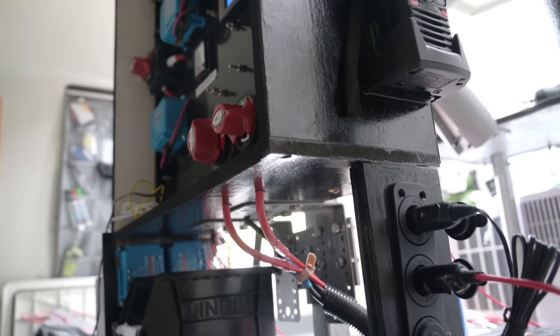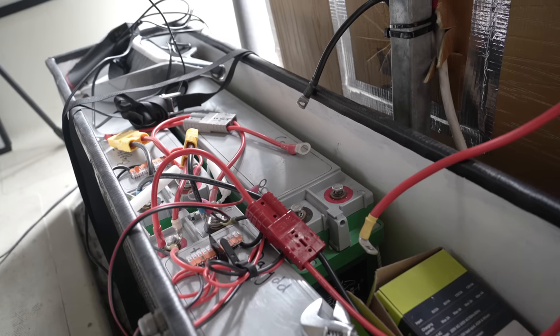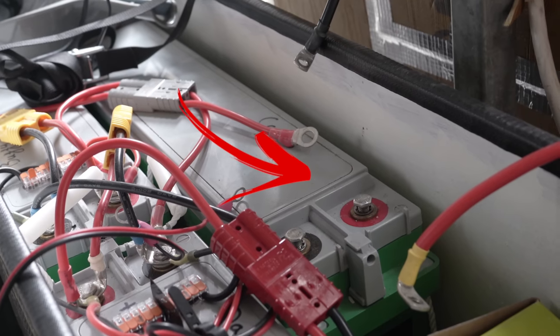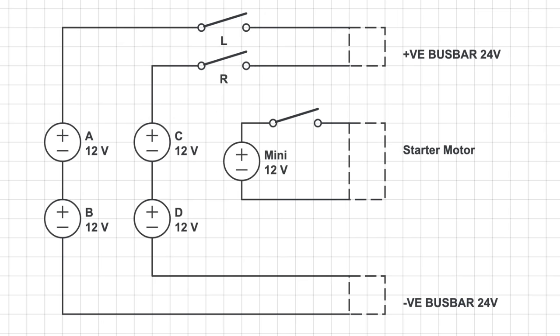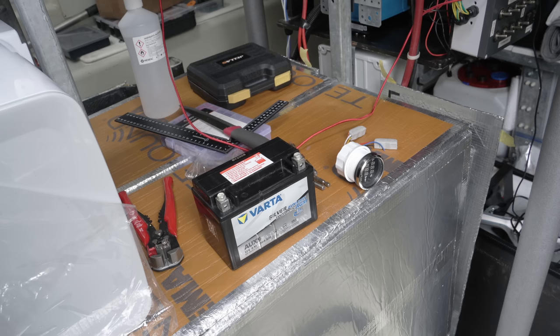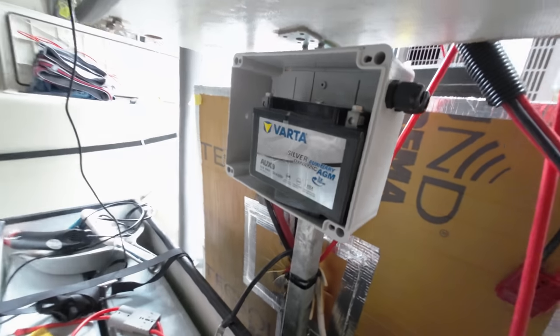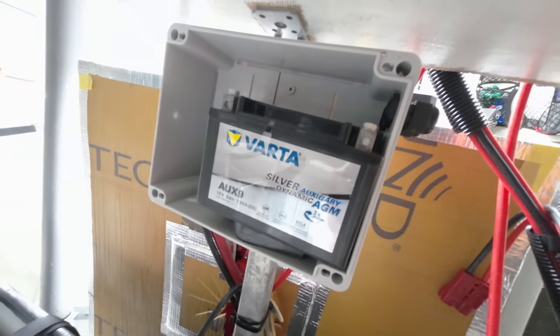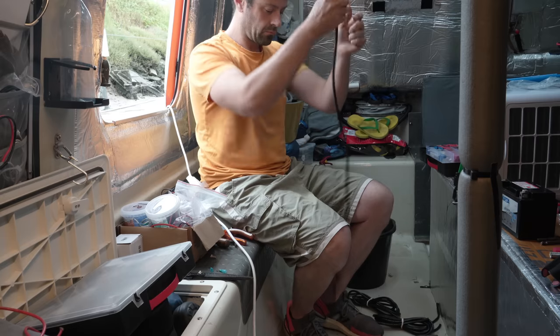We're going to head to the main electrics panel and below to the battery bank box. To date I've run two 12-volt lead carbons together as our main 24-volt power source and a third as an engine crank. I'm saving up to buy another lead carbon so we can have a proper dual bank with 24-volt output. I want the engine cranker supplying 12 volts at up to 100 amps separately, and have sourced a small high-performance battery designed to crank larger car engines in their automatic start-stop systems. I've built it a little home between the battery box and the electrics panel.